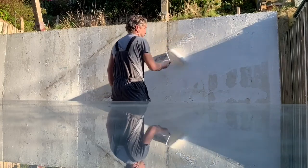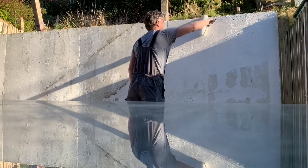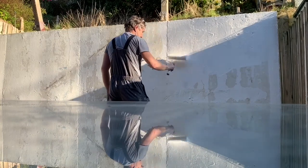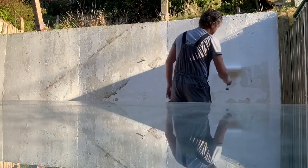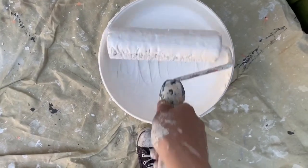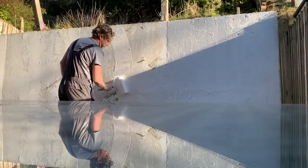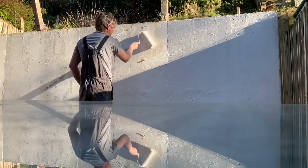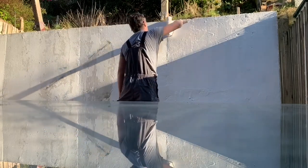It's masonry paint — it's got to go on fairly thick. It's going to make a nice weather shield against the conditions outside. It's not overly thick though; you don't want it all running down the wall as you move away. Put it on thickly and spread it about — a nice even coat all over. When I was taught to roll, I was taught to roll from top to bottom and that works, but you'll find it fatigues the body very quickly. So you'll find me rolling in stages: I roll half the top and then down to the bottom, half the top and then down to the bottom. It's a lot easier on the body and once you're consistently rolling it doesn't make any difference at the end of the job. Just make sure you've got a nice smooth even coat all over.